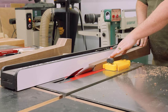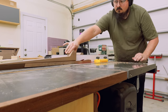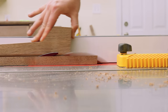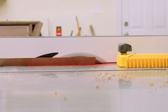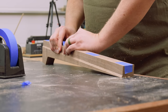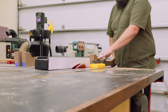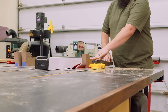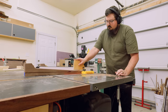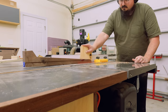With the joint edges all trimmed out, it was time to cut down that outside angle at the table saw. The first thing I'll do is cut in my angle on the outside of all my workpieces. Then I'm going to use some blue tape to reattach my off-cut — this will give me a 90-degree reference for my table saw when I'm cutting the adjoining angle. Because if I didn't retape this off-cut back on and attempted to cut that opposite angle, I would end up with a leg that was super uneven. With my leg all stitched back together, I could head back over to the table saw. The only thing to keep in mind is that once you get past the blade, there's no longer going to be support underneath, so you really need to exit the cut by pushing through the blade.